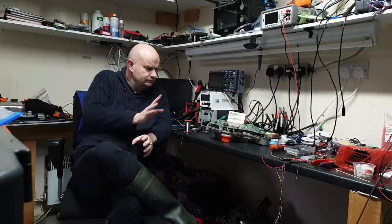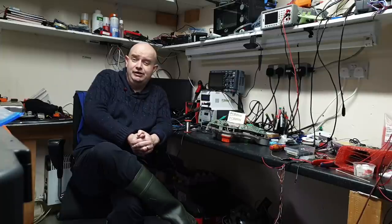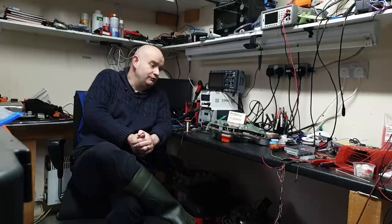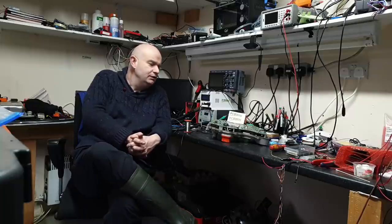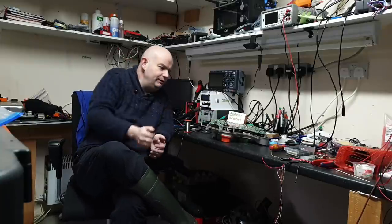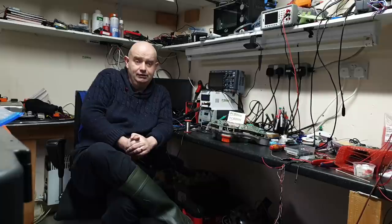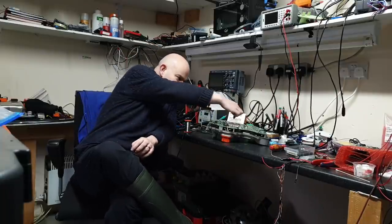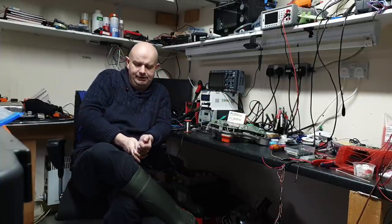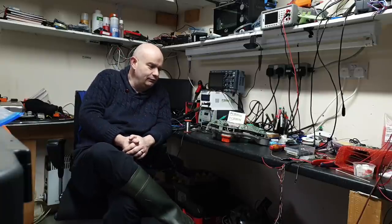Now, when we left you last time, I believe that we had reverse engineered about 90% of the pins on the TMS320F28377D microcontroller that would normally be the brains behind our Model 3 drive unit. And you will also recall that I had removed the kind of mod chip device that I had originally put in there, that had all the little wires trailing all over the PCB. It just wasn't something that I was comfortable with at all when I went back at it.